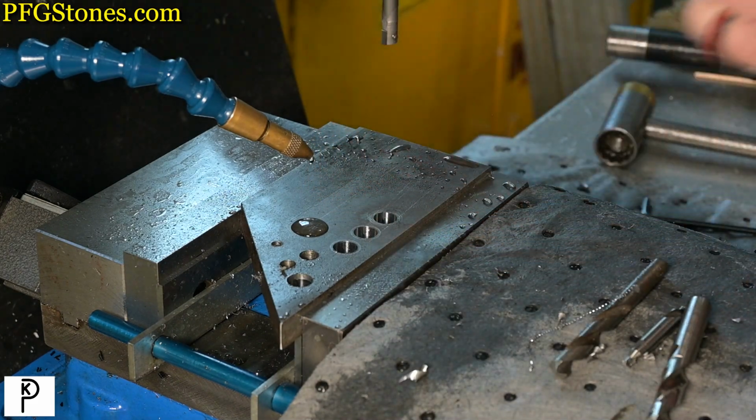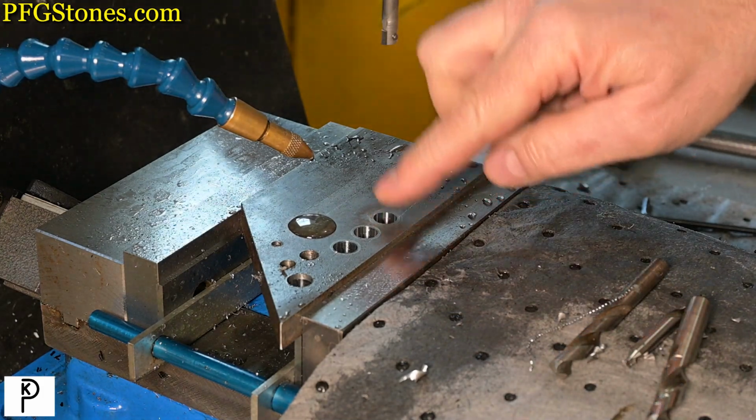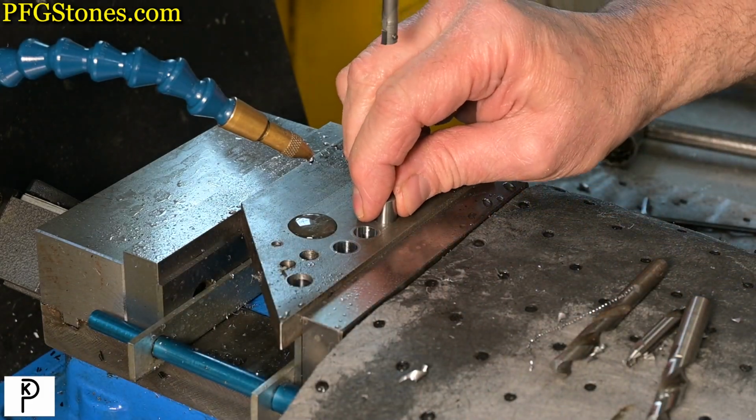So it's 2/1000ths on the diameter. So I think what I want to do is I'll take 1/1000th more on the diameter, and hopefully we get what we want in the first pass. I think that's going to do it. Or I'll leave it the way it is, because we don't know what's going to happen in the new material. This result would be pretty nice. I would have no problem with this result.